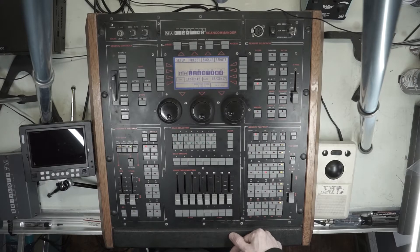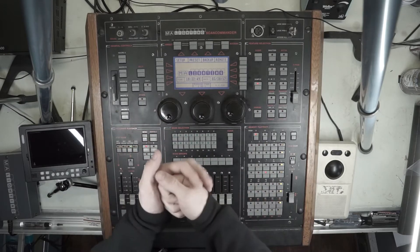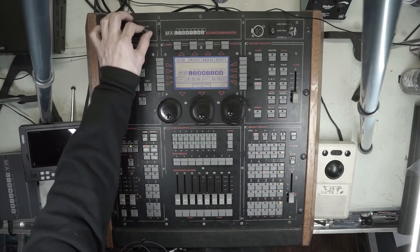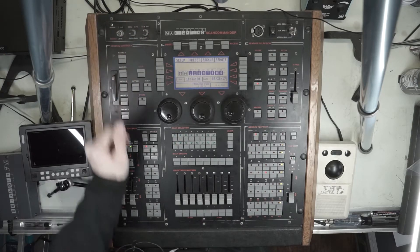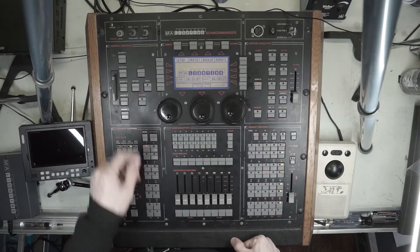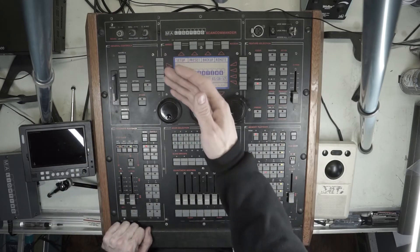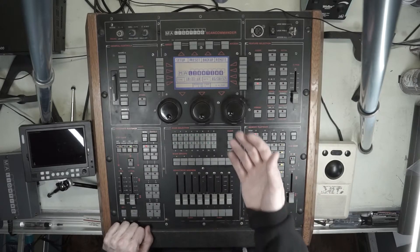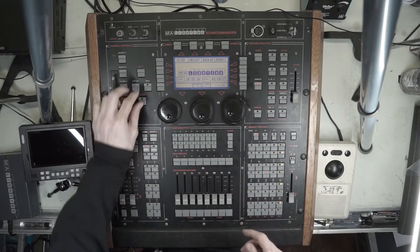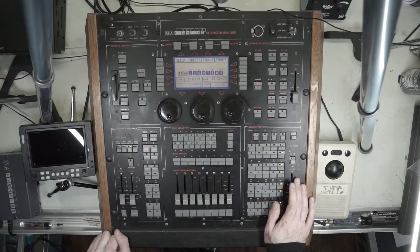A best example would be some electronic music where you have a four-to-the-floor beat going and you want it to only happen on every second drum beat — you can tune in the kick drum so this light starts flashing, bring up your level control, and then move this delay fader up until it's holding until every second kick drum. You have to dynamically be adjusting this, and that's part of the spinning-plates operation of this desk. You also have linear timecode input — you can bring in timecode, record your button pushes live, and go back and adjust it very similarly to how a timecode timeline in an MA2 works. It works really well, actually.